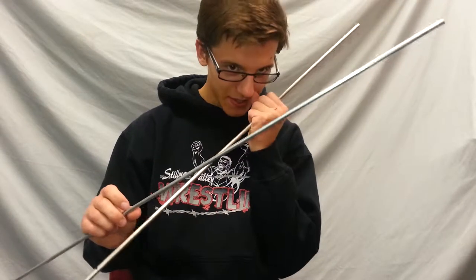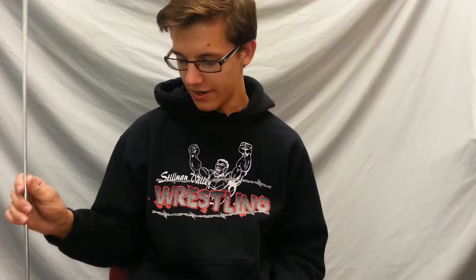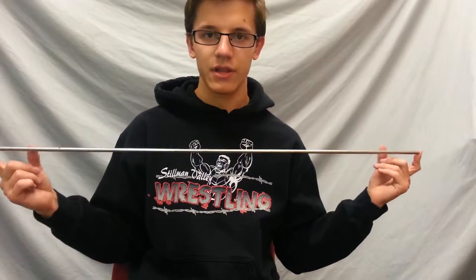So I'm moving down to historically accurate 5/16ths. I was on the fence about quarter inch vs 5/16ths, but the rings are too small at quarter inch and you can't quite fit them together — it doesn't close up right with my 14 gauge steel electric fence wire.